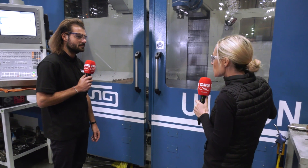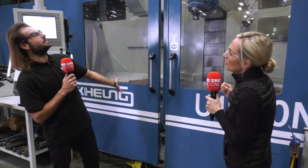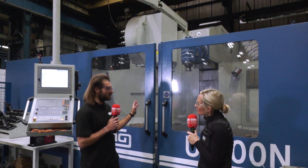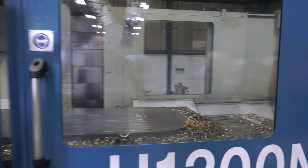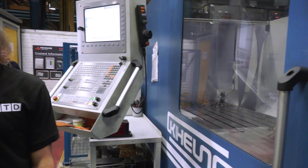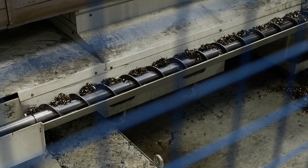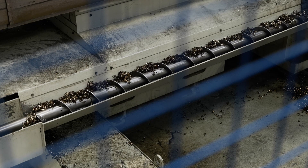For the size of the machine it's quite open, isn't it? Yeah, you might be worried that swarf and chips and coolant are going to fly out of the top, but we've been told there's not really much of an issue with that. On the sides you've got these rubber wrap things that stop the chips getting out. In terms of washing down the machine it's not as easy as a tiny little radial drill, but it's still not much of a problem. The swarf augers go down and the swarf falls away - there's a swarf conveyor on the back right-hand side of the machine, and I'm pretty sure they can tailor it to how you wish.